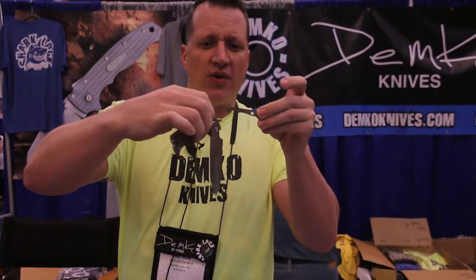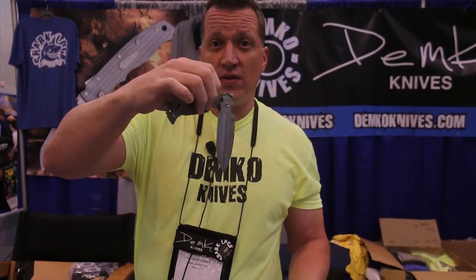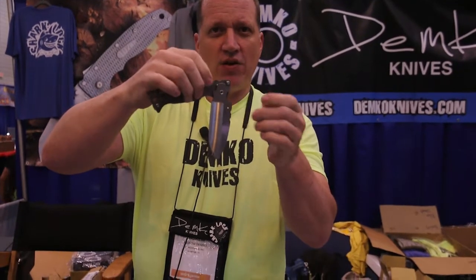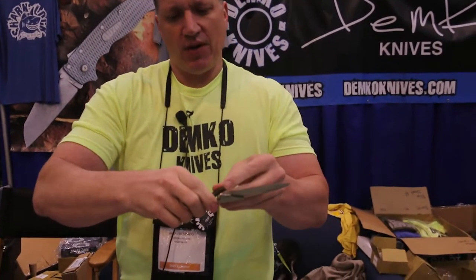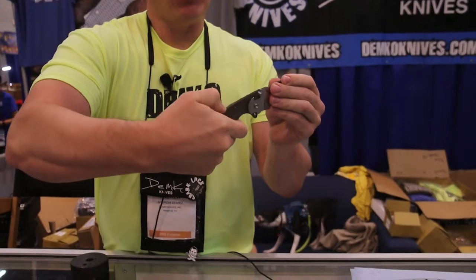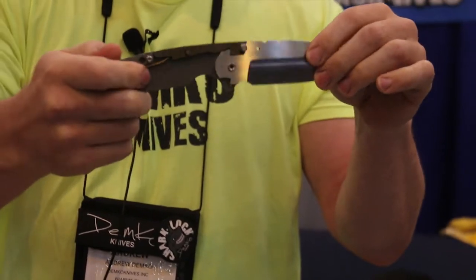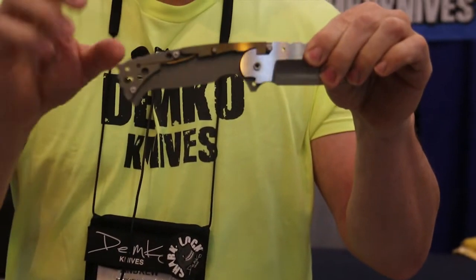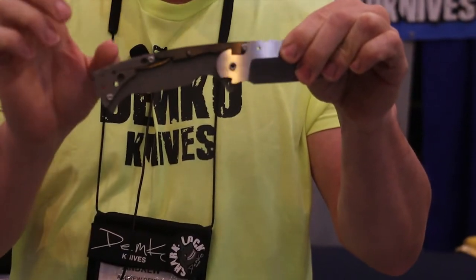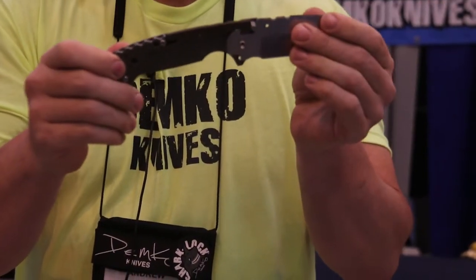What I've done — if you can get in there, you'll see there's a recess. It's a concave radius, and it's the same radius that's on the face of this lock. So as the lock goes in there, it mates exactly with that arc in the pin and gives you a lot of contact area and surface area. That reduces the wear and the deformation that happens in the pin or the lock face under hard use. Now this has a lot of contact area and wears much, much less.